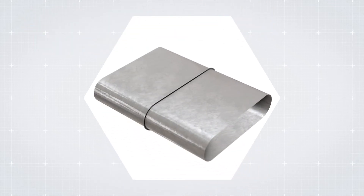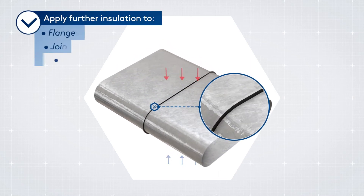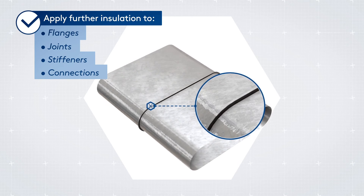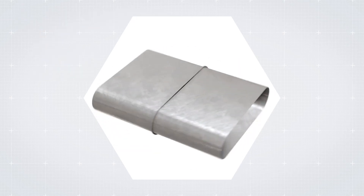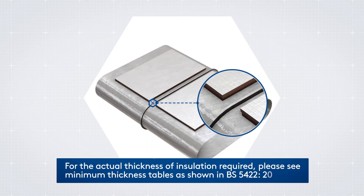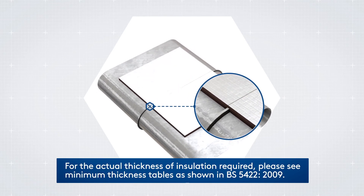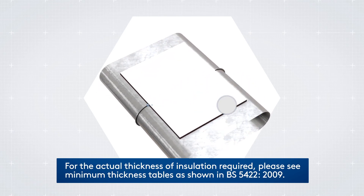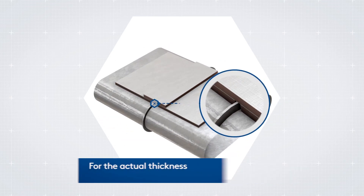In order to optimally reduce heat loss, you may need to apply further insulation to flanges, joints, stiffeners, and connections. The following TICA recommended guidelines should be followed. When the insulation thickness is at least 5 mm more than the size of the flanges, the insulation should be pushed tight on both sides. Apply additional insulation where there is less than 5 mm cover.